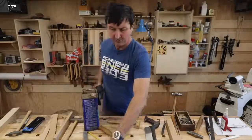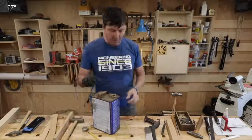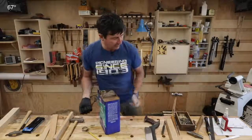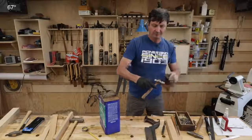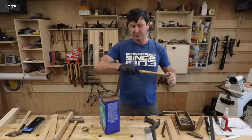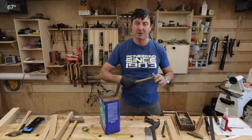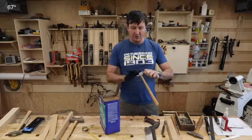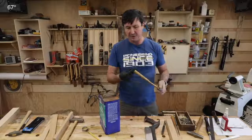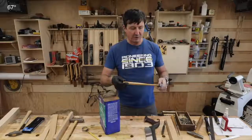There's only one thing left to do — treat the handle. We're going to use boiled linseed oil; you just can't go wrong with that. Wear some gloves, keep Sally happy. Boiled linseed oil is what you want to apply to all your tool handles. The old-timers used to say: once a day for a week, once a week for a month, once a month for a year, and after that once a year. In the fall it's our routine to take all the tool handles, scrape off the mud, sap, and pitch, and give them a good coat.